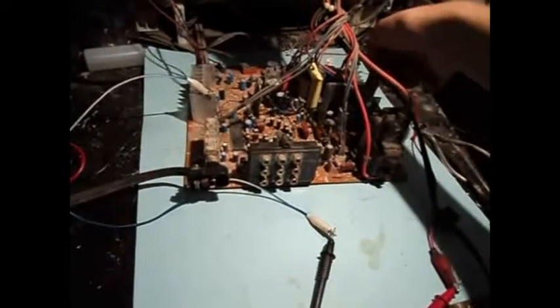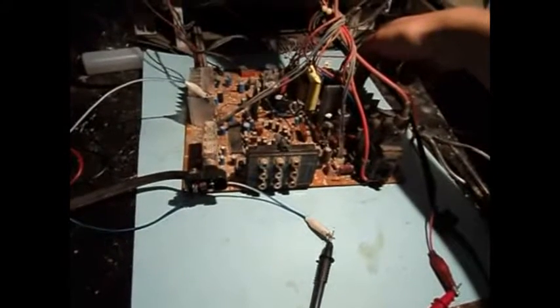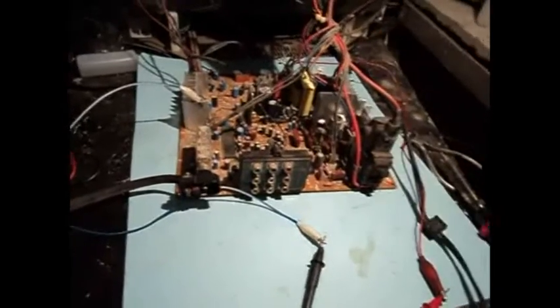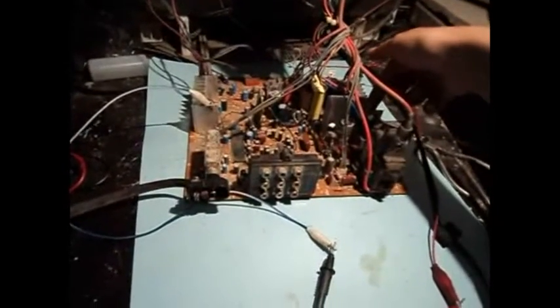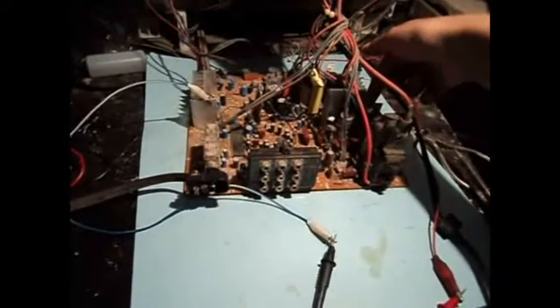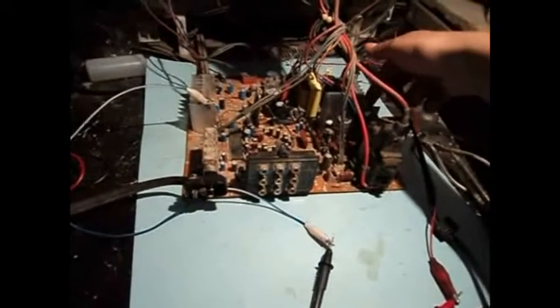Getting a picture! I'm going to monitor the heat on the vertical output, because as it is they get very hot, and if it's a crappy quality component they get even hotter. This thing has been on for about three or four minutes and I can already feel it getting kind of hot — I can't keep my finger on it for too long. Vertical outputs on these kinds of TVs always get really hot, which makes it hard to gauge whether you have a crappy component that's overheating or if it's just normal.